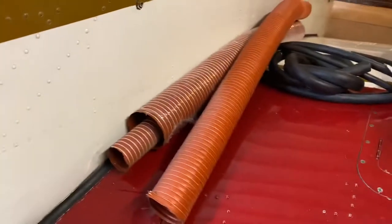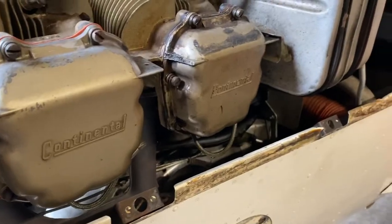We're going to remove all that, replace all the rubber hoses and flex hoses. The heater hose here is rotted. You can see down in there that it's wide open, so any exhaust could have been creeping up in there and getting carbon monoxide in. The whole thing's not sealed. The cold air inlet that goes to the heater baffle and comes out — all of that was just in disarray and not connected, so there's real strong potential for carbon monoxide poisoning.